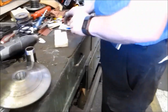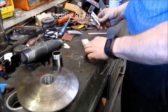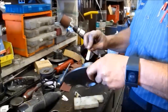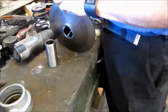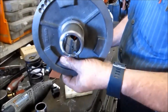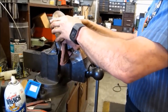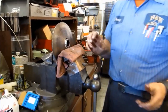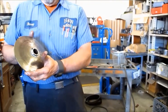Discard your old stick, roll the glue, and get your new one out. Again, right down the middle of the keyway, in here, take your arbor, spray it, and go straight in — no turning. It should push pretty hard; that's the whole idea. And that is it — your bushings are in. Tomorrow morning you can put your keys in, put it all back together, and you're good to go.